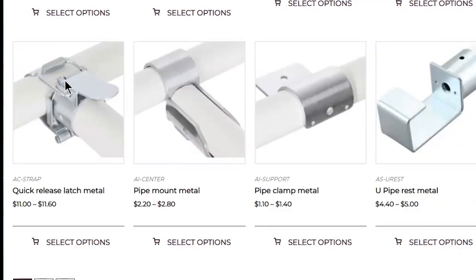I'll have to experiment with that. The nice thing is I have all the parts I need to see how to configure it before making any cuts. Since I've been playing around with the EMT, I've been using this AC strap to latch the one-inch pipe. When the three-quarter-inch EMT slides out, I catch it between the two and latch them together with the AC strap, which holds and bites it down. It's a really quick way to loosen it, slide it, and fix it back into place.